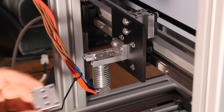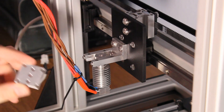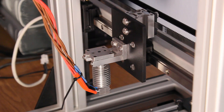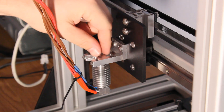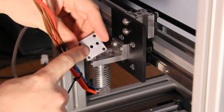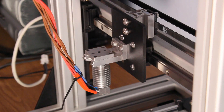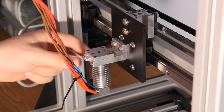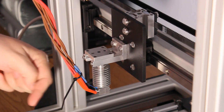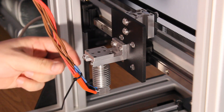What I have here is a block I machined - it's 30x30mm with M5 holes here. What I did to future-proof this machine: if I do want to go for an extra print head, I can slide this one all the way to the back, slide another one to the front, switch it from using the center holes and the Bowden adapter, and use both the edge holes. For now I'm going to keep it in the middle, which gives me the optimal throw on my bed to keep my build area as large as possible - about a little under 10 inches with a single head, dropping to around 9.5 inches if I move them over.